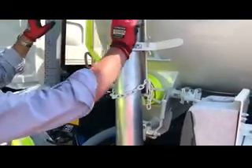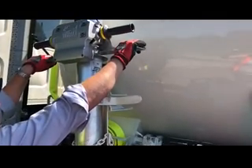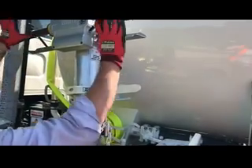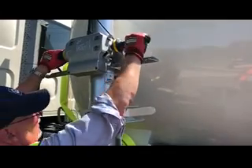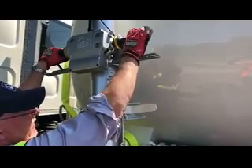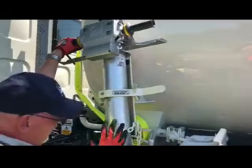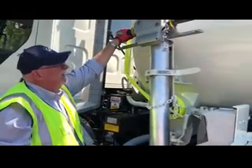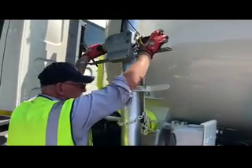The only other bit I haven't shown you is these guards. They're there really to stop you from smashing your knuckles onto the gully brakes. This machine has a hinge type with anti-vibration handles, and you can tell that by the yellow bands — there's a bit of flexibility in these to stop hand-arm vibration and white finger. There's not a lot of vibration through the boom anyway, but this machine has been fitted with the anti-vibration handles. You can have standard handles if you want.